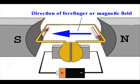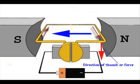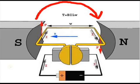Similarly, again, if the forefinger is aligned along the direction of magnetic field, that is from North Pole to South Pole, and the middle finger is aligned along the direction of current in the right side conductor, then the thumb indicates the direction of mechanical force. This is clearly downward here. Due to these upward and downward forces, the turn tends to rotate in clockwise direction as shown.